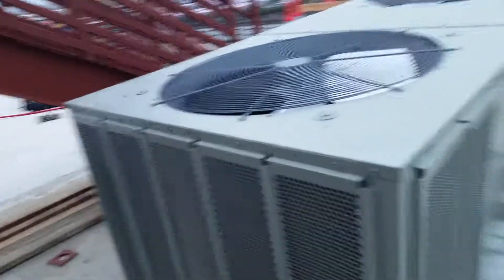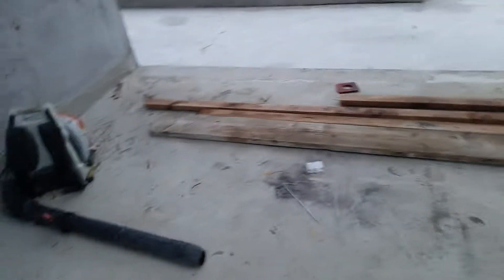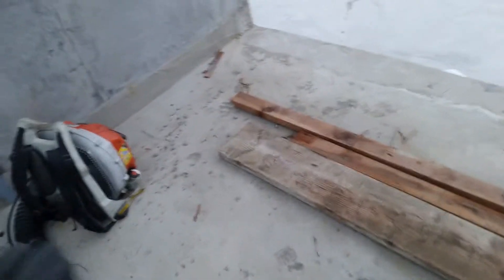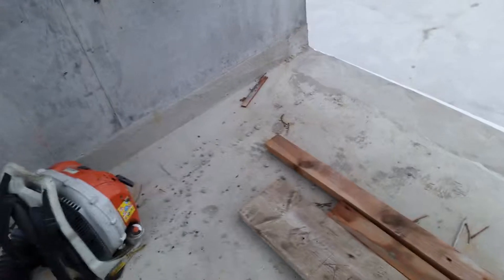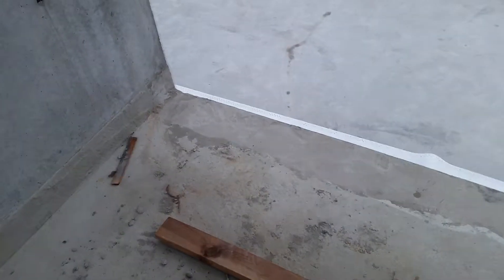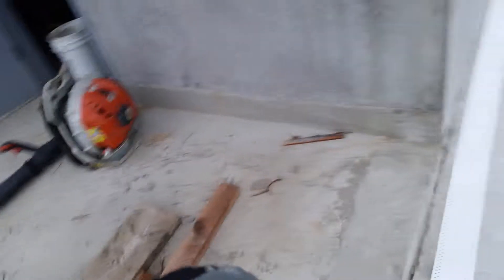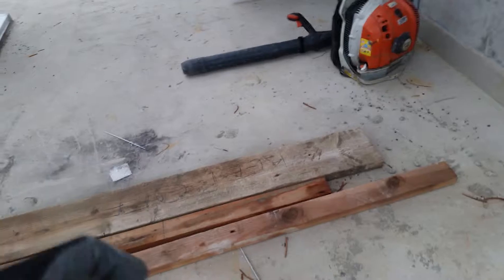It's going to be interesting to see how many times this unit right here gets hit. Regular waterproofing membrane systems that are not protected are going to get gouged. And given that all the computers and electronics are down in this system, you can't get any water in them — otherwise they'll short out, which would be quite costly to repair. So the choice was to go with the MB Elastic and then the Elephant Armor on top to give a protective coating that is flexible but also very hard and durable.